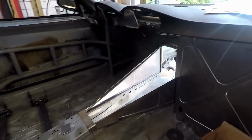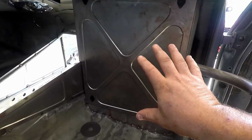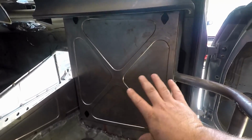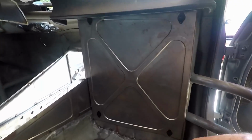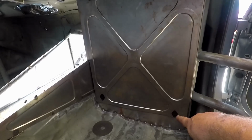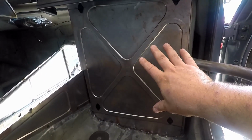now you guys saw me making that trans tunnel, but you guys didn't see me making basically the oil accumulator or dry sump setup block off area. So made this whole section. It's just held in there with those little Zeus fasteners, so quarter turn fasteners. This plate comes off and the whole oiling system will be behind there.